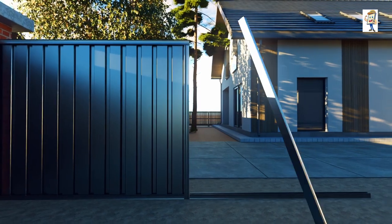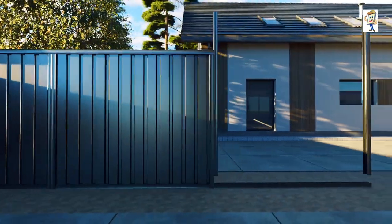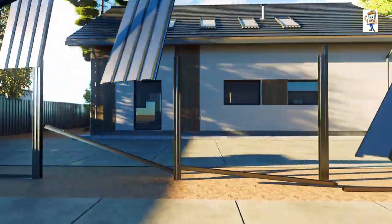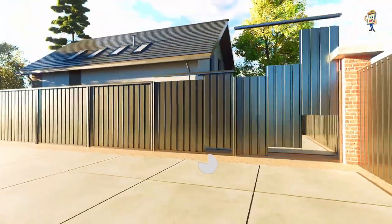Step 7. Stand back where the fence is seen the most in the yard or from the entrance to the yard, and adjust the top and bottom rails to appear straight and plumb, then screw the corners of each panel on both sides of the fence.